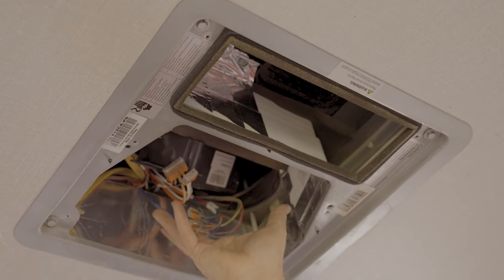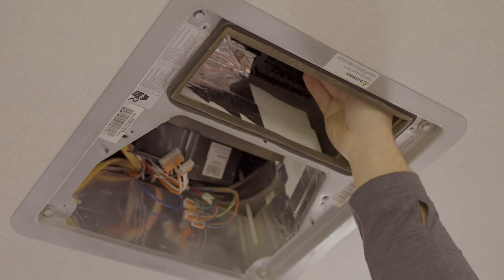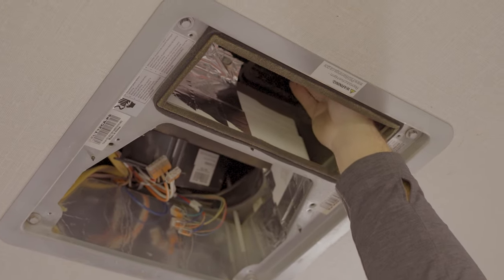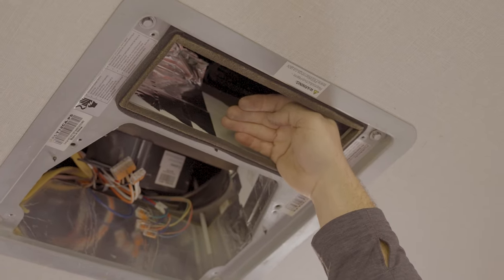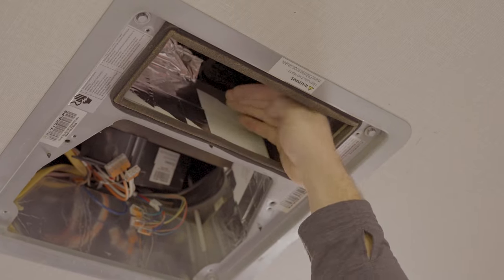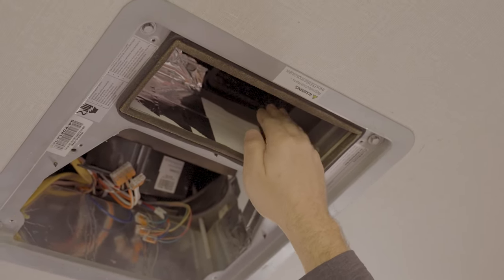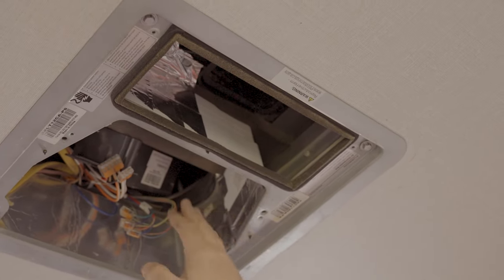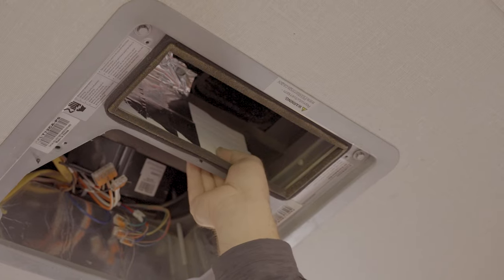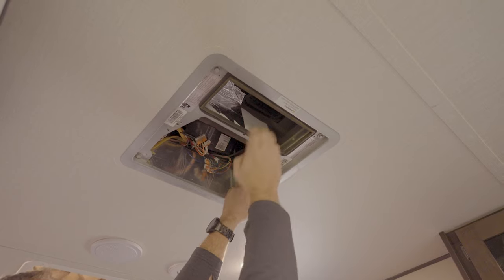This is your air intake side. So you have air going up through here, and this is a pressure side, or your supply side. Cold, conditioned air is coming out of the air conditioner right here, and it's gonna hit this point and choose to go left or right. It's also gonna put added pressure on here. So what you don't want is the air to find a way to sneak through this center divider into this section. That separation between these two cavities is very crucial. So now we have it all sealed up, or we're feeling pretty confident everything is sealed up here.